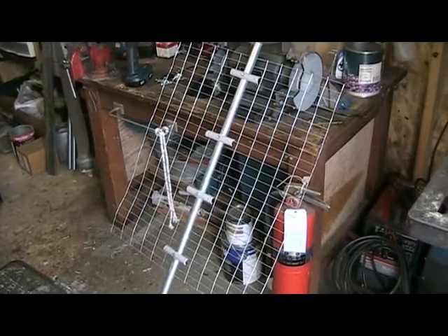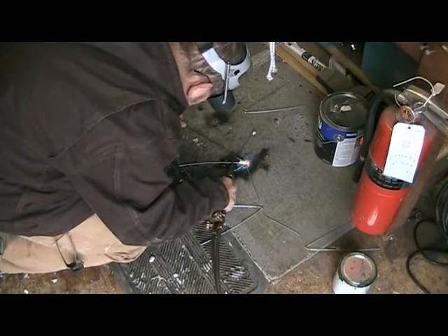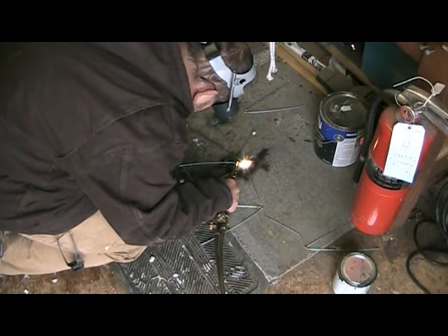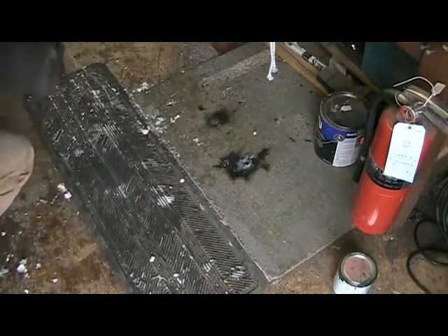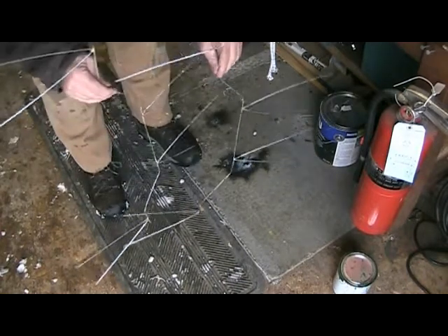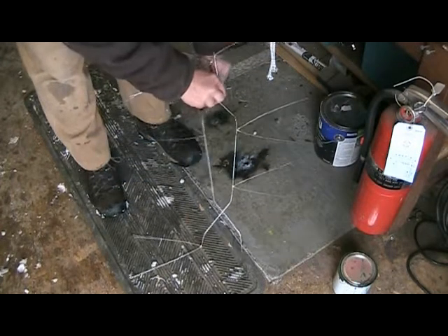I'm brazing the radials together on a piece of asbestos here. You can attach them with screws — the center wire just connects the bow ties together. In this case, just to make it pretty, I've brazed them. So these are the two pieces and they go together on the antenna like this — the crossovers don't touch; you'll make these lift up from each other. There are your eight radials that will be on the antenna.